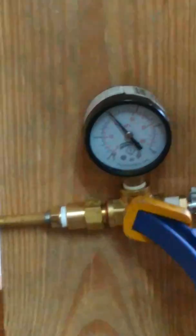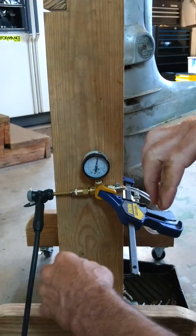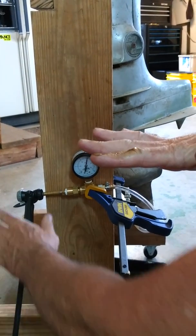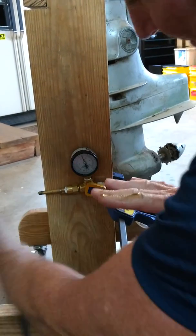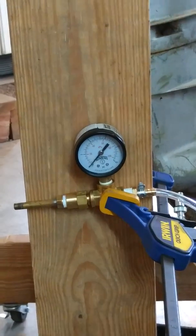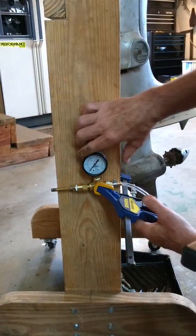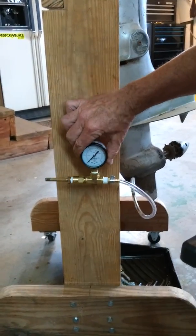When I put this on, this will fall pretty quick because in addition to what we got going on here, we got bad seals. I can hold the pressure with my hand, pop it off, and you can see she's just not holding pressure. Thus, we need a seal kit in the lower unit. And there you go — it's that simple.